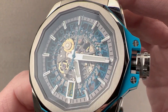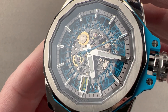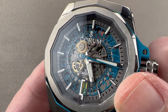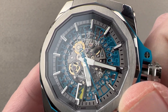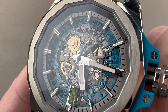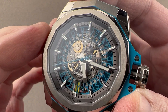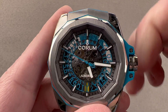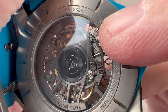The movement is skeletonized and nickel anthracite-coated. We also have an unusual date wheel — rather than having double-digit dates with numerals abreast, here we actually have them stacked in tandem. There are a couple of different setting modes: hacking seconds and a quick set, so you can rapidly cycle the date and appreciate how it is backlit, though skeletonized, by that yellow panel at six o'clock. You can see the whirlwind — that's what I call it, the whirlwind or hurricane jumper — that swaps the dates when you're using the quick set of a Sellita SW300 or an ETA 2892. A 2892 is the basic architecture here. A Sellita makes a version of the 2892 that is then modified by Corum's sister company, Eterna, which is a formidable movement manufacturer. And I know this because if you flip the watch over, you can see the historic Eterna logo inside the skeletonizations with the ball bearings surrounding the E.